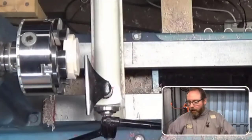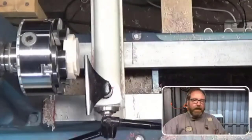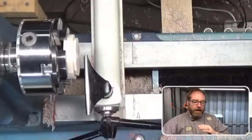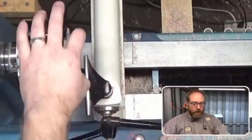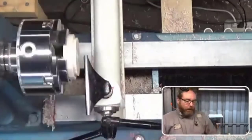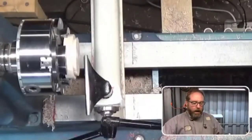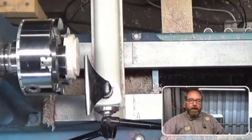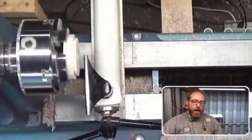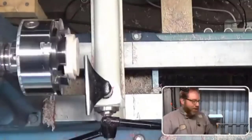We all know that for a piece to sit and be steady on a table or a shelf, it needs to be turned, it needs to be running true, it needs to be concave so that only the outermost points of the foot are touching the table. And I feel that when a wood turner takes the effort to make the foot correctly and blend it into the design of the piece, that's one of the true signs of a good wood turner. But that's just my opinion.